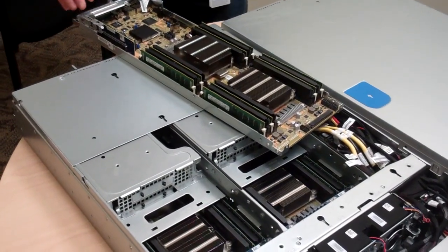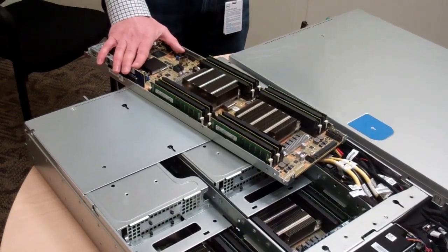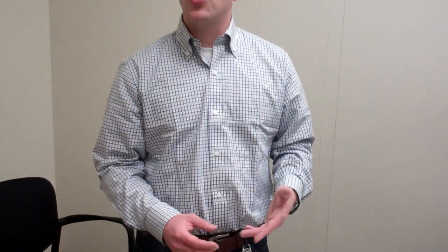The difference is that it's now all PCI Express Gen 3. The ecosystem is still being built out in the industry for Gen 3 supporting devices, but when that ecosystem builds up, we'll be there to support it. So that's a x16 and a x8 in our 1U sled at Gen 3 speeds. We've also added a microSD card on the riser to support better embedded hypervisors for virtualized workloads.